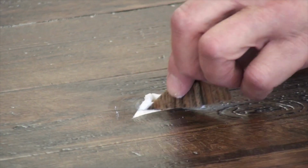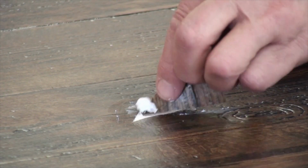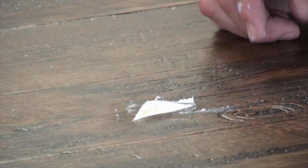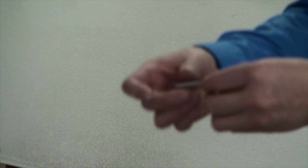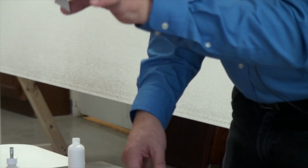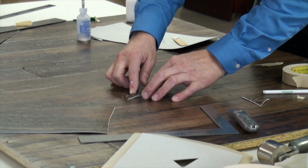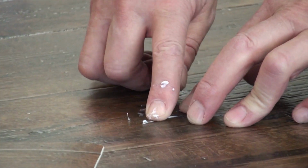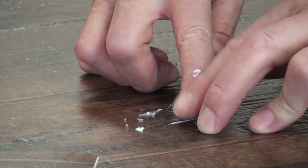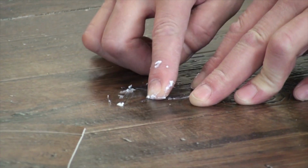And then I will take a scrap piece and remove a little bit off the surface, but I want to make sure it's on my underlayment. You want to cup this. I really do want to make sure that I get it all the way inside the seam edges. So cup it. Insert the repair section. And then make sure that you squeeze up through and get the bond and seal. And as it implies, it's bond and seal.